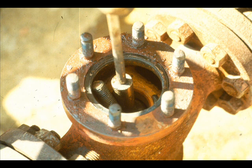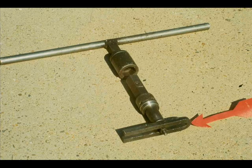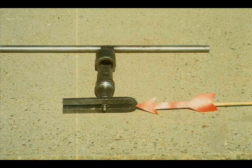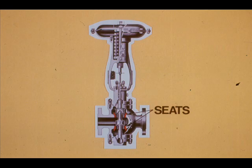Check the plug and seats for damage. If the plug or seats show signs of wear or damage, either replace or have them machined. To remove the seats, use a seat lug bar. Engage the bar, put the keeper on the seat lug bar, and turn it counterclockwise to remove the seats. Make sure you put the seats back in the valve body correctly. Remember, on a double-seated valve, one seat is slightly larger than the other.